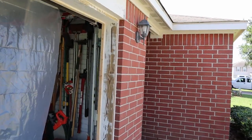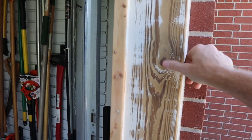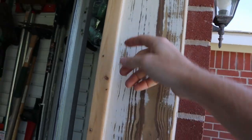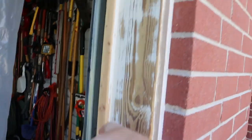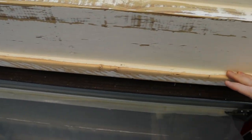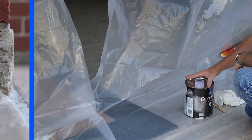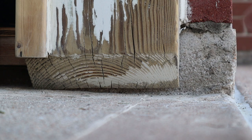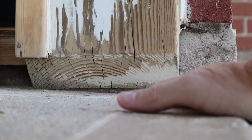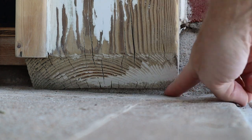When I say paint, I'm just painting over the areas that are going to get caulked. I've got some primer I put right here, but I'm not going to paint that because it's not going to get any caulking — same with the nail holes. Around here there's a crack on this side that I'm going to do. I primered down all of these corners here. Got my Sherwin-Williams Duration paint. Next, while that paint dries, I'm going to take my oscillating tool and cut this board that's touching the concrete so nothing is making contact with it.